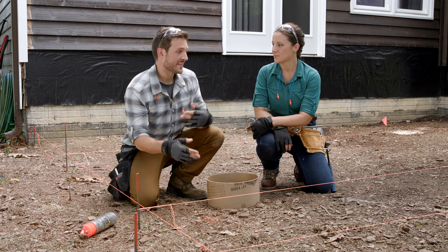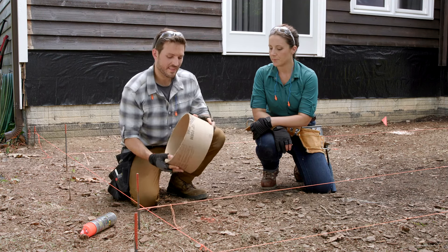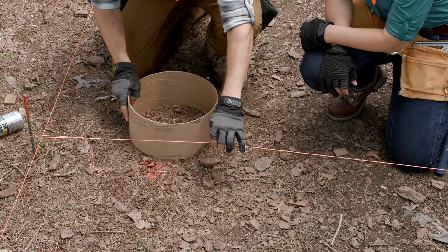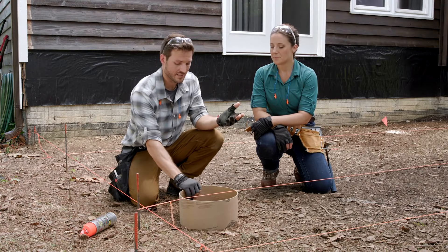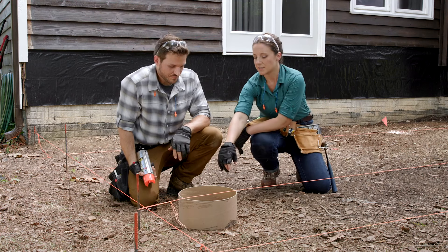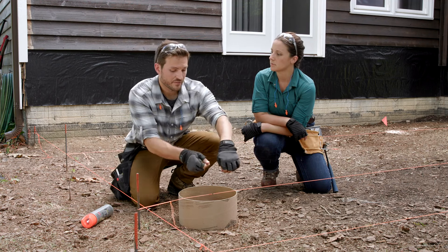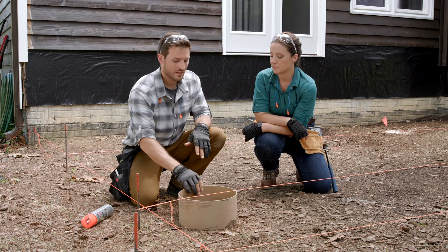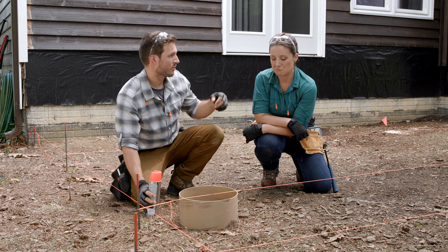We've transferred the marks down to the ground — these mark the center of our footing locations. Now we're going to find the perimeter where each post hole is going to go. A great way to do that is to take a 12-inch concrete forming tube, since that's the diameter of our holes, and slide it underneath as a pattern. As long as we line it up with the center mark we already have, we can paint around the inside to show exactly where needs to be dug out. If you didn't have a tube, you could take a 12-inch measurement, put your six inches at center, and paint a circle in two directions — but the tube is a really quick way to do it, especially with two people.